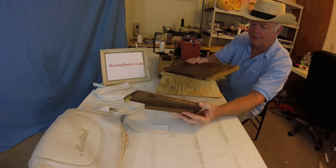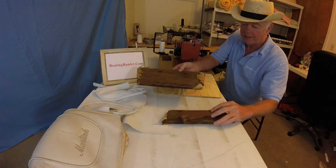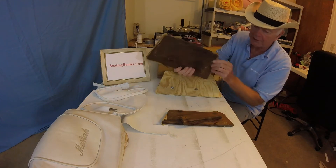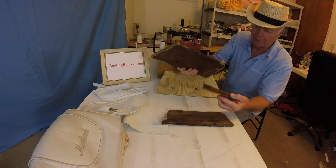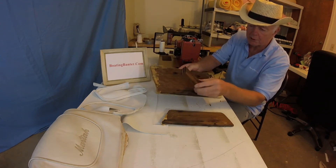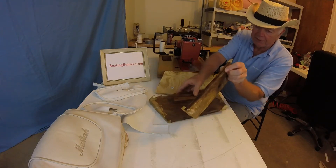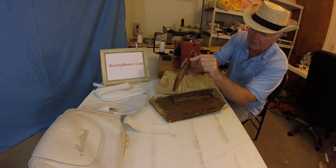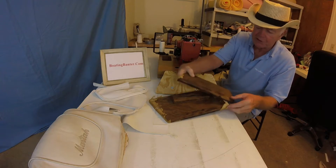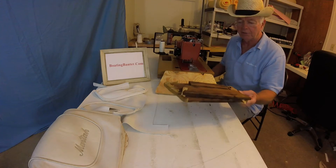Not to be disparaging to Mariah, but that's what you're putting there. They're expensive boats and putting this crap in there is really a shame. As you can see it's all warped. What bothered me the most — there were no screws or glue, all they used was staples. And they didn't even bevel that backing like this one here is, so it didn't even sit right. This was a product that was destined to break. Shame on Mariah.